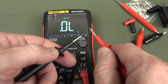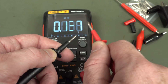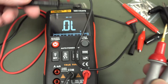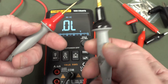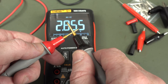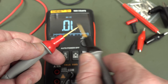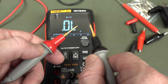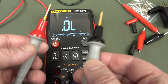Continuity tester. Wow, that takes a while — that's pretty slow. But it is latched, just particularly slow. It turns out that's more to do with the probes than the meter itself. If I use my gold-plated Probe Master probes — oh yeah — it's actually really quite good. It's just the crappy probes it comes with, all the crap on the surface of those tips. Nice good gold-plated probes. So I re-evaluate that one — it's actually pretty quick. I like it. It's latched and it's loud. Nice.